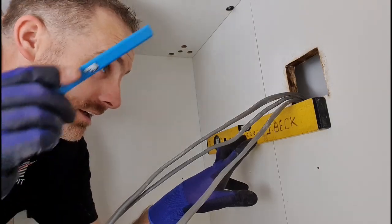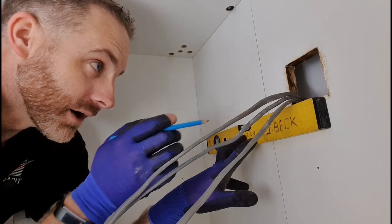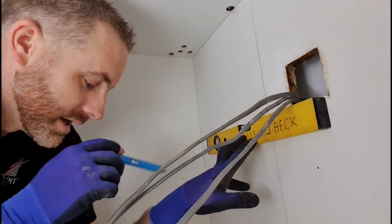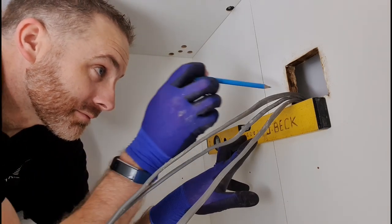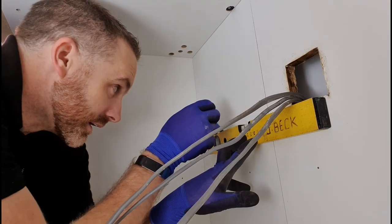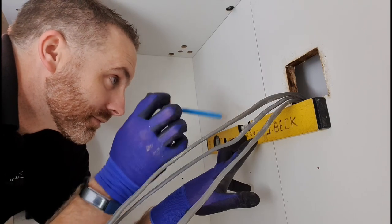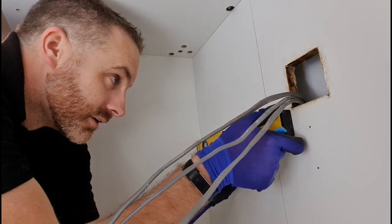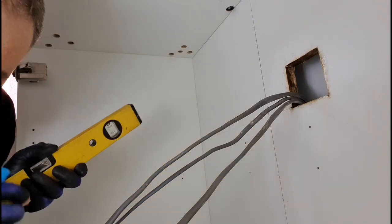I've been fishing and I can't find anything — I can't fit my hand in that little hole. So I'm going to transfer the level across and put a level line going right across here. We'll put some bigger boxes in, which hopefully I should be able to squeeze my hand into. I'll drill lightly, join it up a bit here, make sure it's nice and level, and transfer the line across. One box over there, one here, and one there — that's the plan.